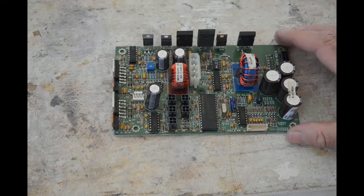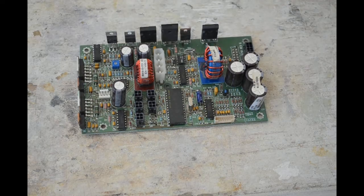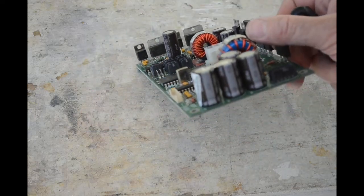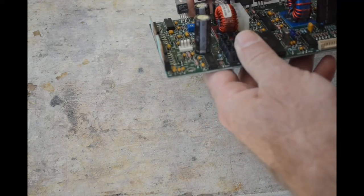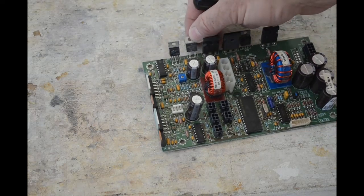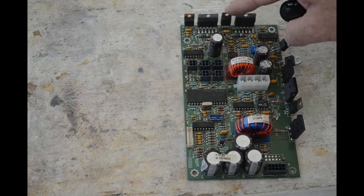Let's see, this board here has a whole bunch of really tiny glass barrel diodes here, here, here, here, over here. But some of these big things that I told you were transistors and kin of transistors earlier on are actually power diodes and diode arrays. Some of these packages, let's see, which one is it? I know I saw it here. This one right here. Notice it only has 2 legs on it. That's a power diode. That is not a transistor. And one of these, I forget which one it is now, I think it's this one here, is actually 2 power diodes in one pack.